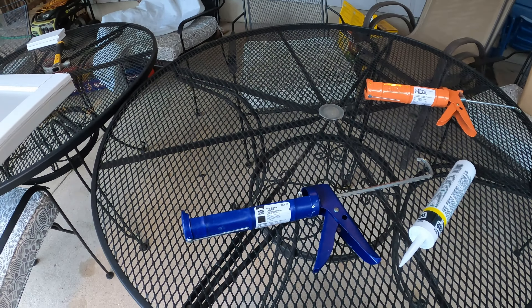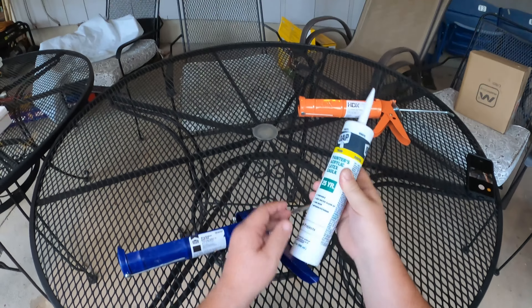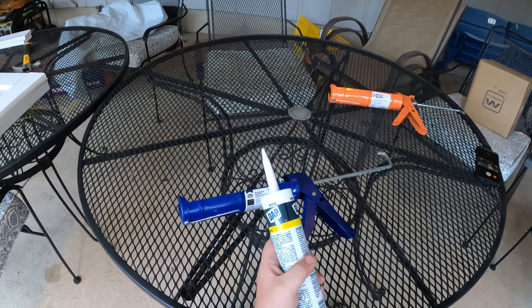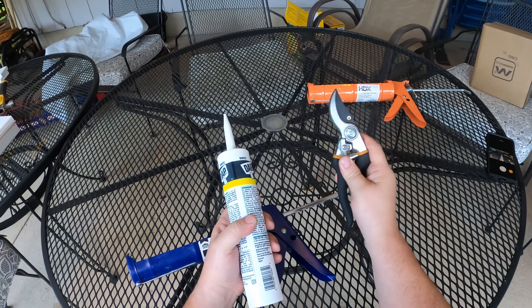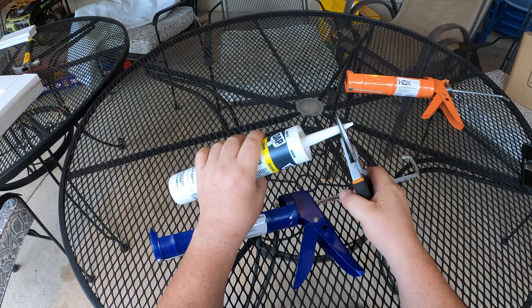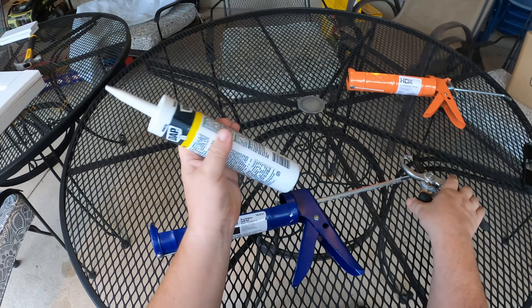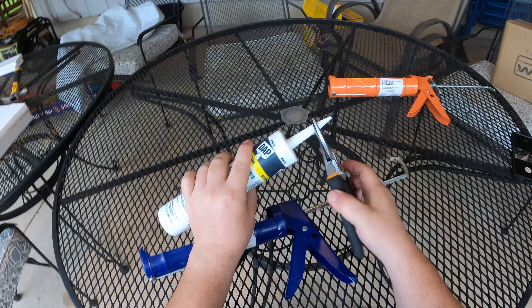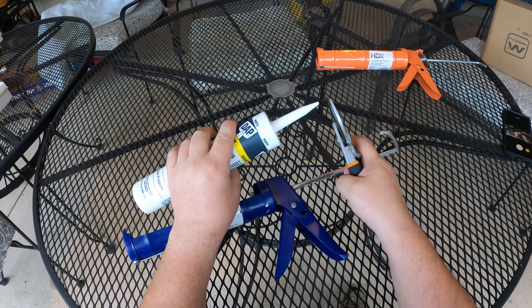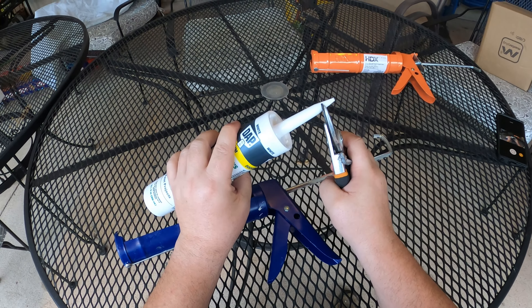So how do you use a caulk gun? The first thing you have to do is load up your caulk. Caulk comes in clear, white, and lots of different products — from glue to tar for your roof. First you have to release the caulk by cutting off the top; you can use a razor blade, but I usually use garden trimmers for more control. A rookie mistake a lot of people make is cutting too much off the top. Keep in mind the bigger the nozzle, the faster this is going to come out. Always start small — you can go forward but you can't go back once you cut.